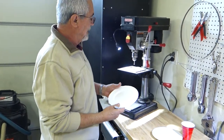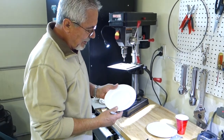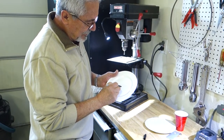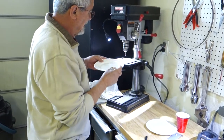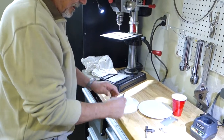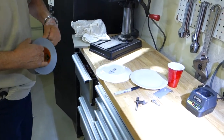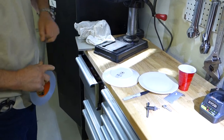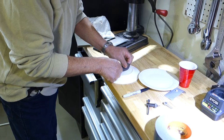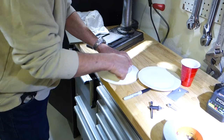We're going to drill a hole into this plate using a diamond tip drill that you can purchase online. First, find your center — I can see it right here. Mark it so there's no mistake on where the center is. Before you start, put a piece of tape on the back side so it doesn't shatter or break at the very end. Take it very slowly at the end when you're drilling.